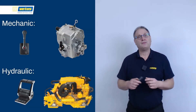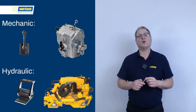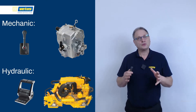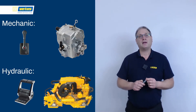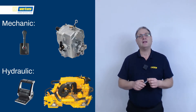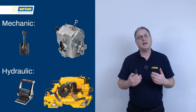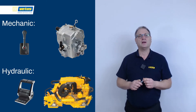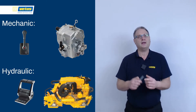There are two main families of gearboxes. On engines up to about 80-90 horsepower, typically a mechanical gearbox is fitted. They're strong, sturdy, small, and very reliable. You should operate a mechanical gear with mechanical cables, and they take a little bit of force to go from forward to neutral to reverse. They are also on-off switches — you're either in forward or in neutral gear — so they can respond a bit clunky. You feel a clunk, you hear a thump, and then your boat starts moving.